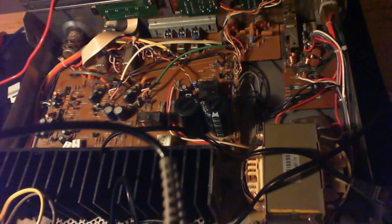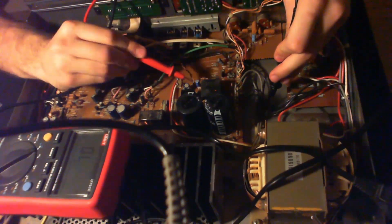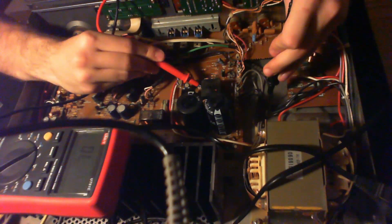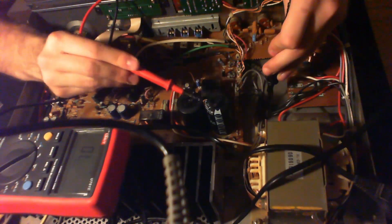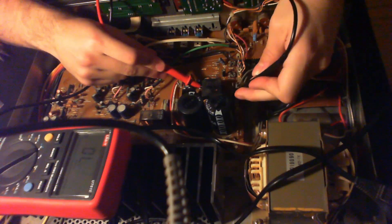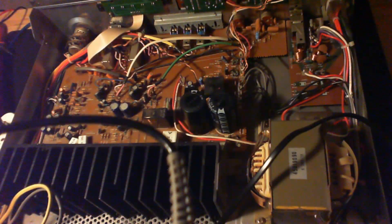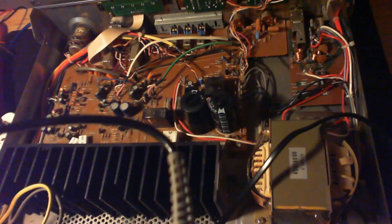Checking for voltage, then the fuse is back in. Checking for continuity — nice. Measuring the power rails for any shorts before powering up: plus to ground shows OL; the capacitors were initially discharging but now showing OL. Between the two rails also OL. The capacitors are charging up. Let's power up — nothing blows up. Very nice. Relay closes.